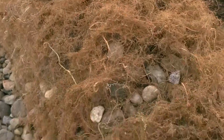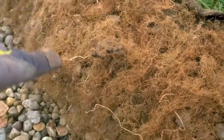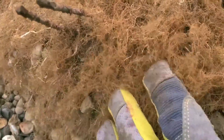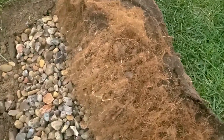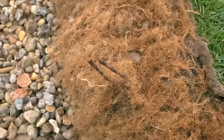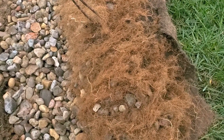What you see — that's roots from grass plants. You've got different sizes depending on the grass type. If it's bluegrass, it's a vertical tap root. Certain grasses have rhizomes where the roots come through the fabric and then they grow along with the fabric. No matter what, as long as the root comes through the fabric, that's how water finds its way into our French drain system. Here's a system 10 years old — here's one of our fabric pins that initially held the fabric in place.